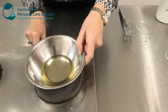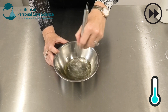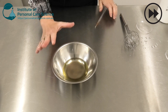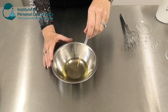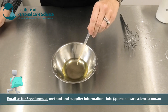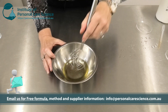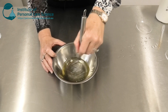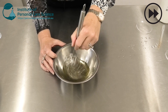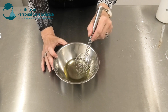Once everything is fully melted, I remove it from the heat. I let it cool to around 55 degrees — much below 55 degrees and it starts to set into its gel form, which would make mixing more difficult and prevent a fully homogeneous dispersion. At that point I add my antioxidant and continue to slowly mix until it forms into its gel.